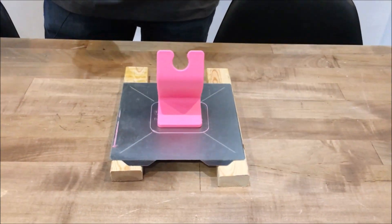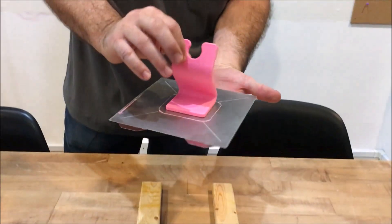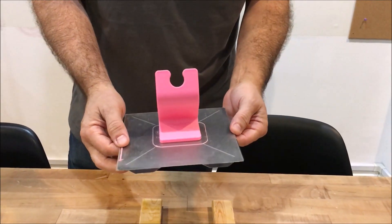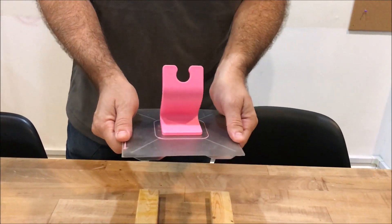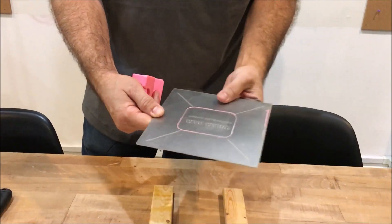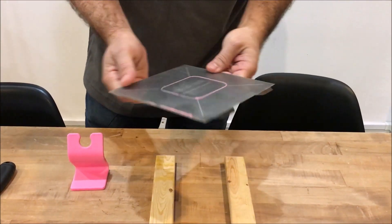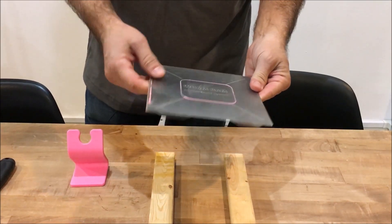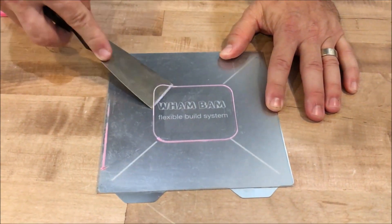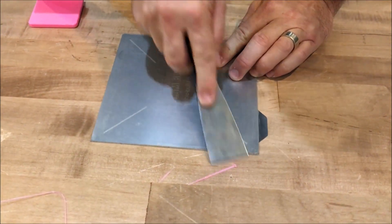It's been about two minutes and I'm assuming it's cool enough. Usually when it's cool enough the part will just lift off magically. All I have to do is flex this slightly and the piece should just pop off. If there's any resistance you can flex it from two directions. This is not a build surface you've got to chisel. For some of the fine single layer outlines you might want to just ease it with a spatula — once you get under there it just comes right off. You don't need to scrape or pry.